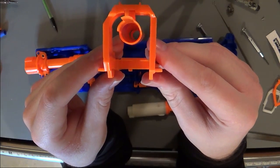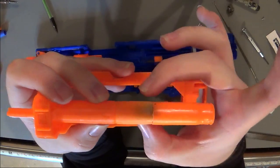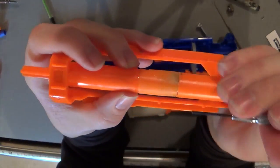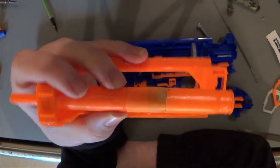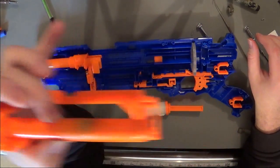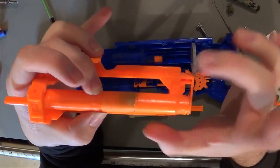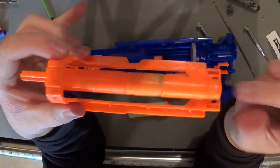That is a small piece of 1/2-inch aluminum that's sandwiching these two together. It's just running from about here to here, and then the whole thing's super glued up. So it should stay together. Most of the force that's going to be on this is going to be a backwards force anyway, so there's no flex in any other direction too much. So this should hold up nice and sturdy.